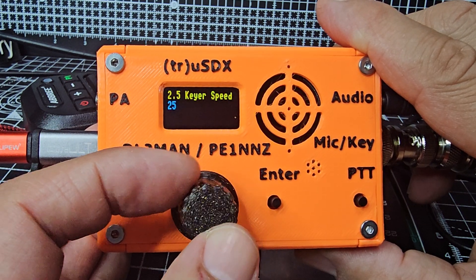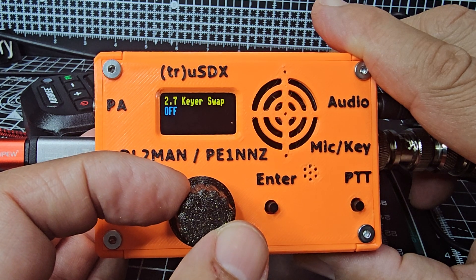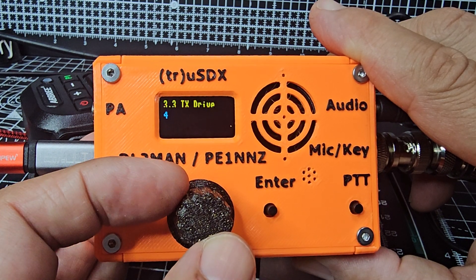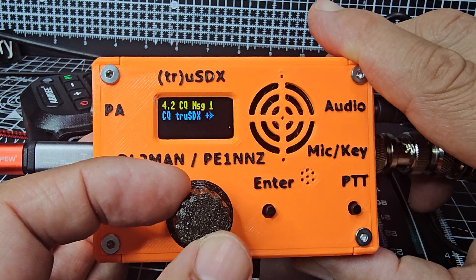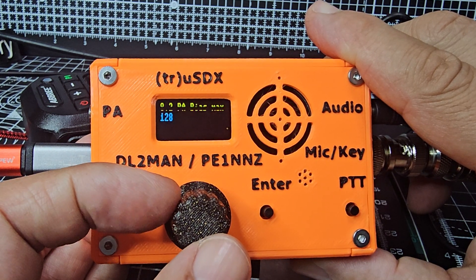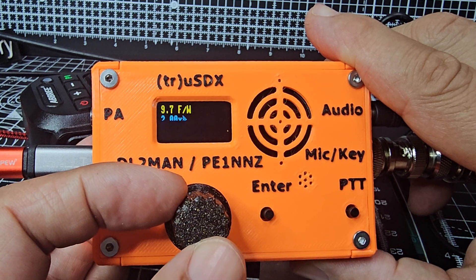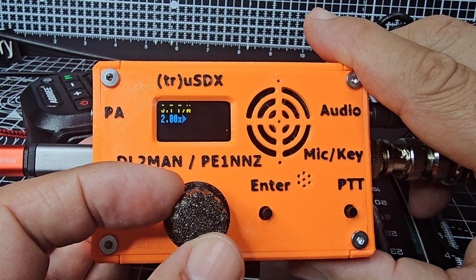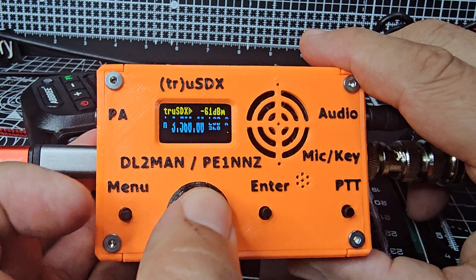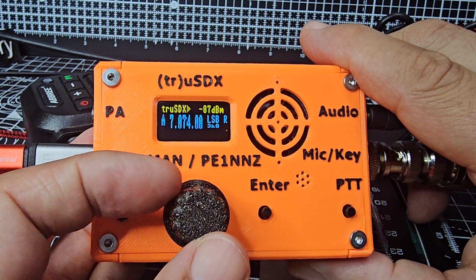Semi QSK — is that a CW thing? Key speed, key mode: straight — let's see if it's got paddle... yes, like Iambic, there you are — you can select what you like. Key swap — is that right and left, I guess. Vox, noise gate, TX drive. These settings include CW preset messages it looks like. PA bias, reflect, REF frequency, and then shunt, LPF config. Is that the firmware version — are we on 2.00? I think we are. Volume and back, so we'll exit that. Back to 40 metres, quick tune, LSB we're already on.